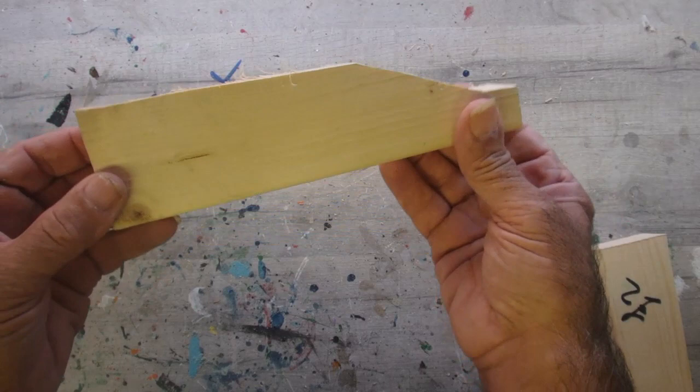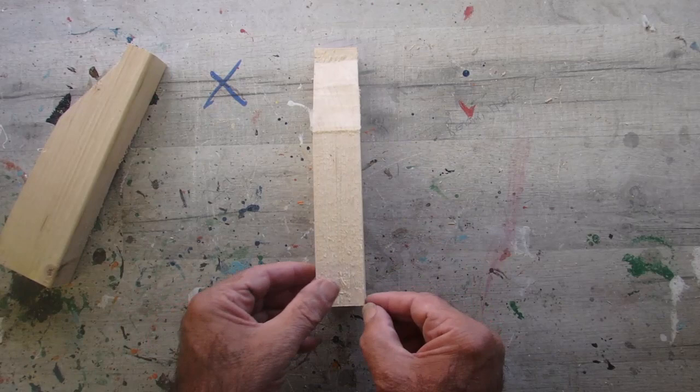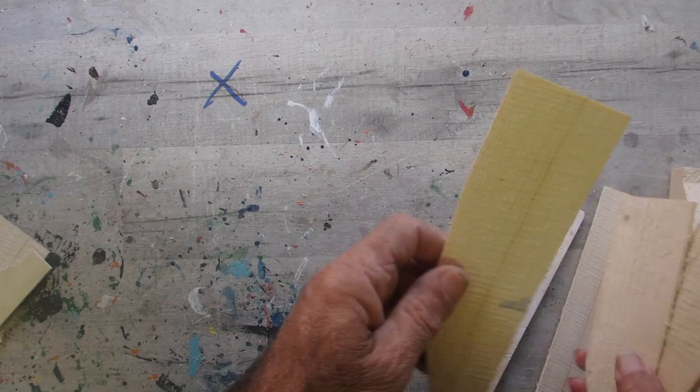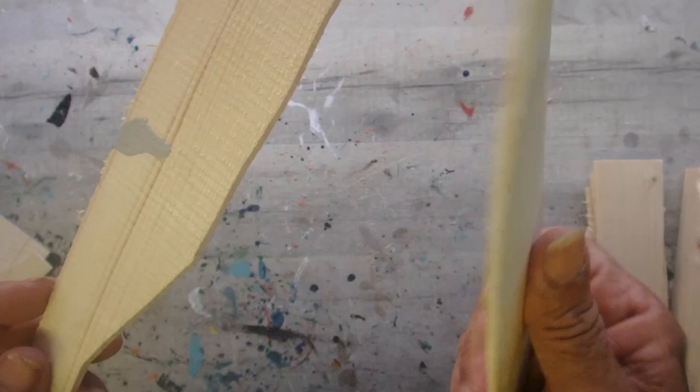Originally, as you can see, I did the blades at an angle, and then I would put them on the bandsaw and just take a slice off like that, which I thought was quite good. It took ages to do. But the biggest problem was, as soon as the bandsaw blade got a little bit blunt, I used to get all these edges on it. I don't know if you can see that on the camera. Can you see the edges? And I was spending a lot of time sanding them down